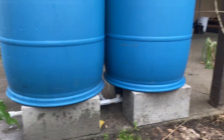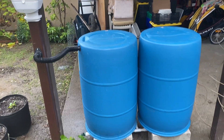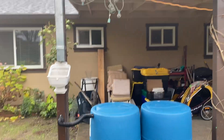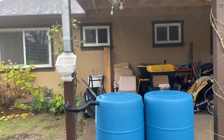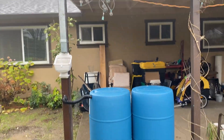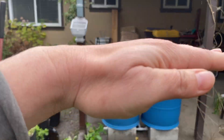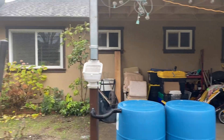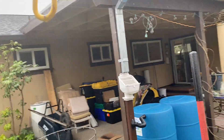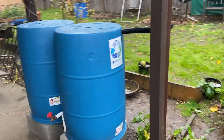The simultaneous overflow is actually optimizing the inflow rate. The whole system is plumbed underneath with three-quarter inch pipes — all the parts, designs, and instructions are included in our DIY rain kits. Your system can't fill any faster than water can move through that under-plumbing, and what it's doing is equalizing the water across the whole system so both barrels are filling and maintaining a level simultaneously.